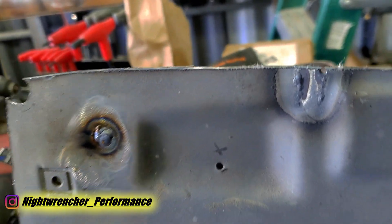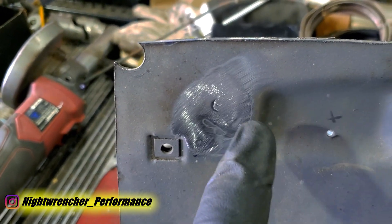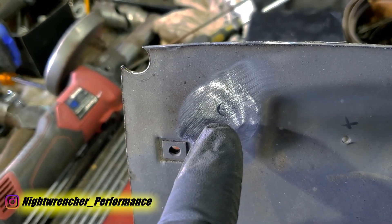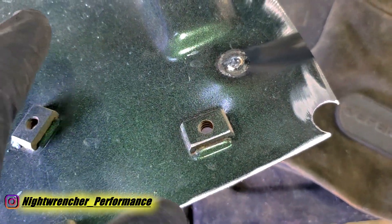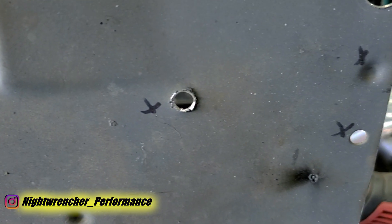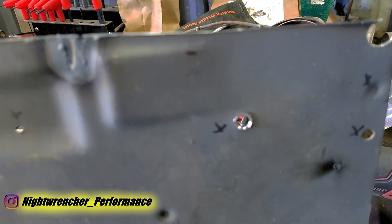There you have it — it's all welded up. After letting it cool and grinding it down flush, here's what the weld looks like. I tried to take off as little material as possible. There's a small bump and a black mark — that's from the impurities I mentioned. As the paint burns and boils, it creates air bubbles; the air bubbles take the place of the weld and create voids if the air can't escape, as you can see here. On the back side, if it's visible you can hit it with a grinder too, then body filler and paint primer.